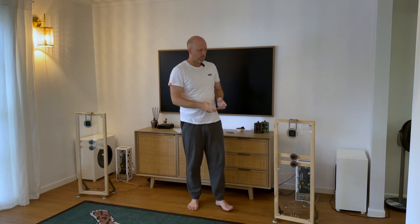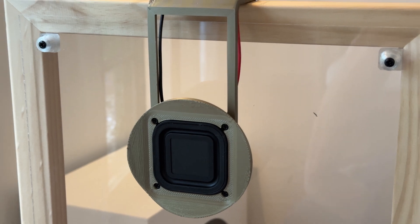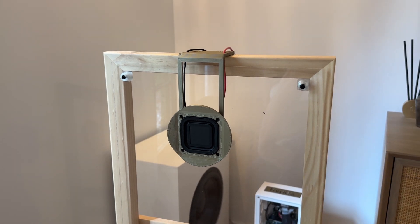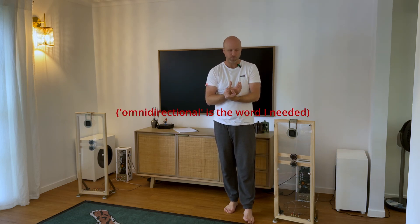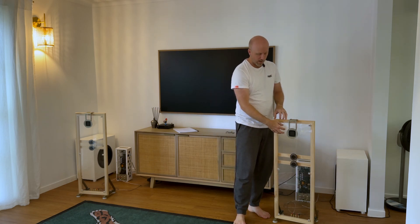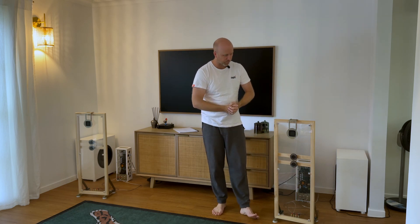The other thing I've done — you might notice I've got these surrounds. They look a little bit like waveguides, though I didn't really intend them as waveguides. The reason I put these on is because I was worried about the output from the panel. Remember, some of this is low frequency — these panels play down to around 150 hertz, and 150 hertz is low enough that the sound can completely wrap around. My thinking was that some of the energy out of the panel could come out and affect the actual BMR driver, so I added some little wings around the outside to see if that makes much of a difference.